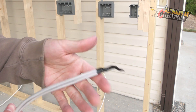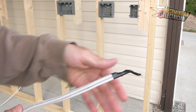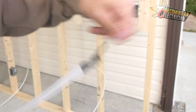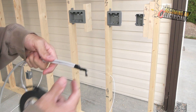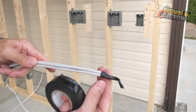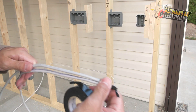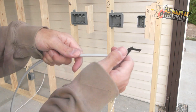In the commercial scene you lube wires before they go into pipes — you always leave a little handle so you can pull the tape off easy. When sticking wire through a hole, the tapered end goes in nice and easy. Tape it back a bit further so it doesn't pull out on you while you're pulling — gives you more grip. That's a little pro tip.